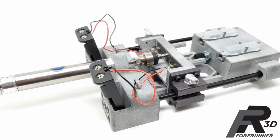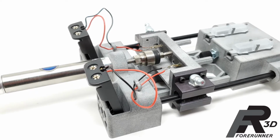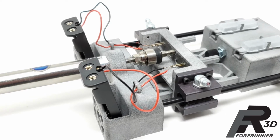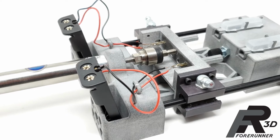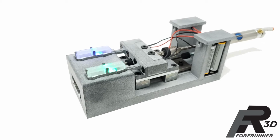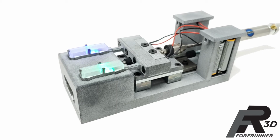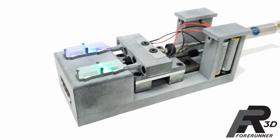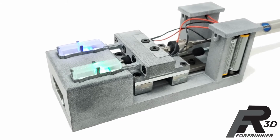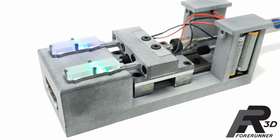In order to prevent damage to electronic components, the material that is used to hold them must be ESD safe. To test if a material is indeed ESD safe, we need to measure the surface resistance of that material. A surface resistance that is too high allows for a static charge to build up and cause potential damage to sensitive electronic circuits. A surface resistance that is too low can cause unintended conductive paths between test points and produce crosstalk when testing electronic components. The proper range for surface resistance is between 10 to the 6th and 10 to the 9th ohms.